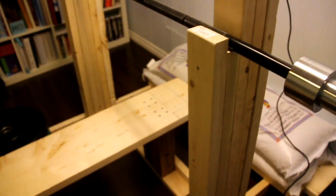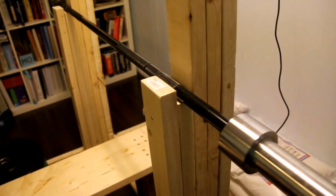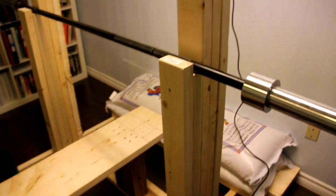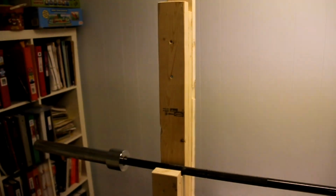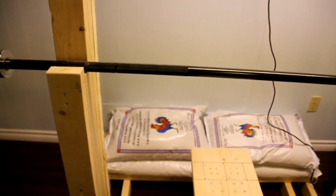So it's super simple and super easy, and having an electric drill would make this a lot easier of a job to do, although you could do it without a drill. You could do it by hand, but it would just take a bit longer. And by bit, I mean a lot. So that's how I made these 2 posts. Everything mirrored. So 76 inches here, 76 inches here. 59 inches here, 59 inches here. It's very important to have them the equal length, because if they are not equal, it will be very unbalanced and it will make lifting really awkward and somewhat dangerous.